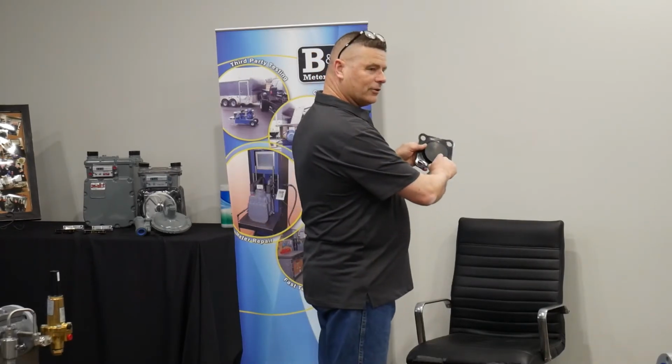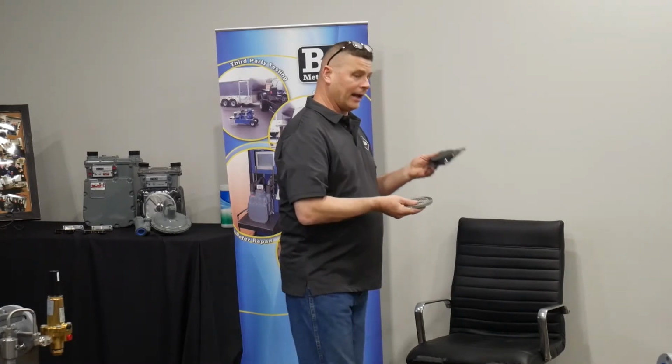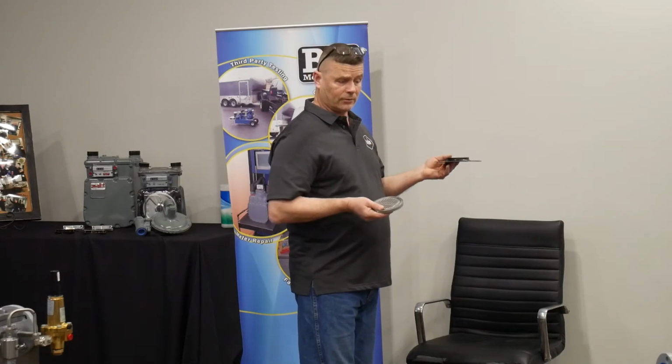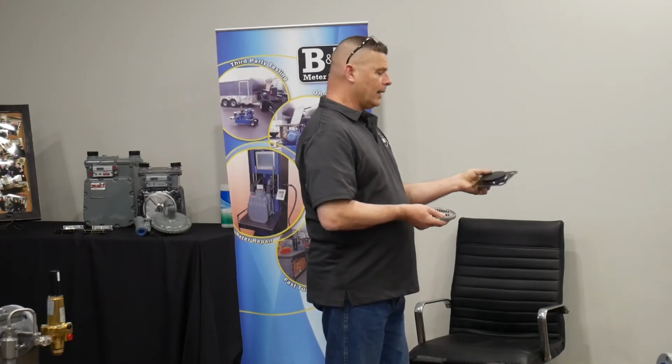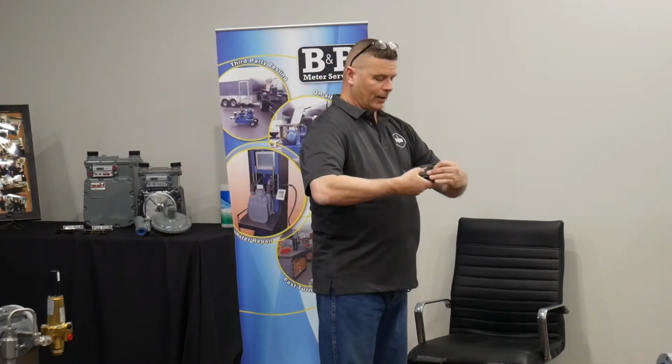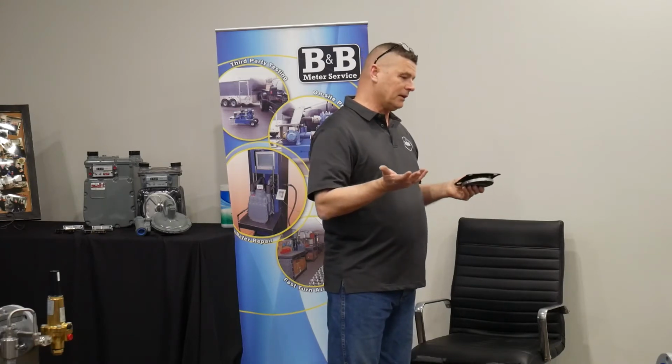So when you look at a diaphragm, you can tell which was the downstream side when it's pulled out, because that's where you'll see the heavy marks, the wear. And oftentimes, if they have no other solution on hand but they need to get this thing back operating, they'll look at it and say, okay, that's a lot of wear. I'll flip it over 180, make where it was the upstream side the downstream side, and give it a new wear point. And it works great.